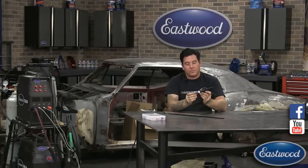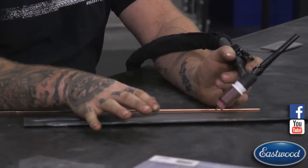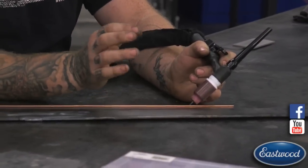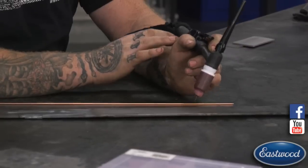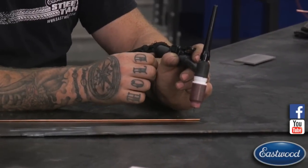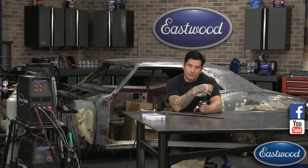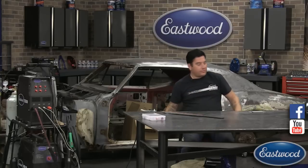Getting back to torch angle: if you have it pointed too far, it's going to shoot out onto the workpiece and heat up a larger area. You're also going to have problems melting your filler rod before you're ready. This is especially important with aluminum, which has a lower melting temperature — it will affect it even more than with steel. Joe is going to come around with a special camera lens so you guys can see what we call 'under the hood,' and I'm going to actually change my torch angle to show you what it looks like so you can identify these problems in your own welding.